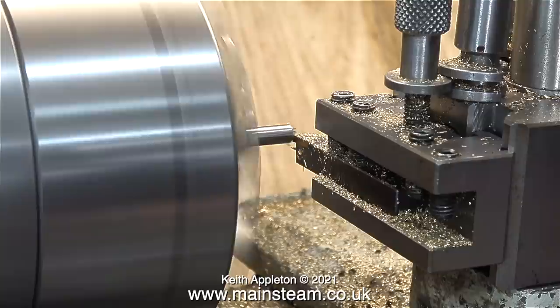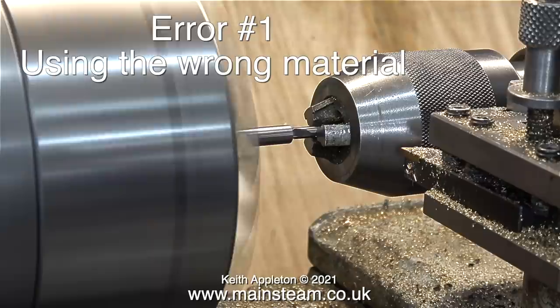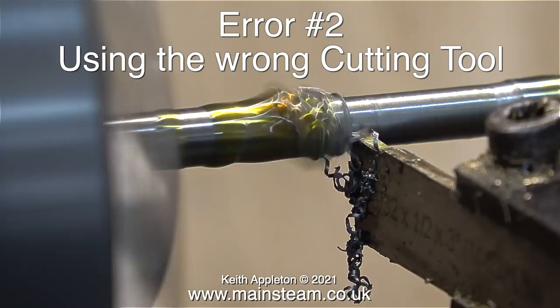This was my first attempt at a hinge pin and I used silver steel, which is the wrong material — it can't really be painted in this application and it will go rusty. This is error number one: using the wrong material. I'm also doing this job completely back to front — it's not very logical — and I'm using my parting tool to do all the turning. This works quite well and gives a good finish, but at some stage I need to use a micrometer.